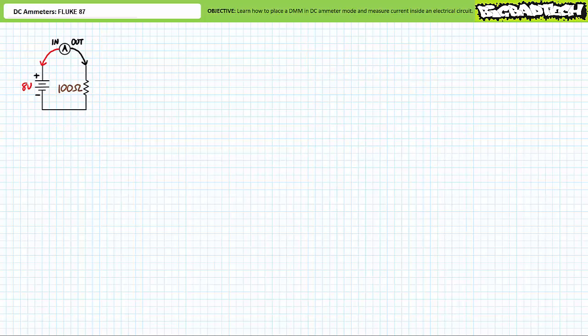Build the circuit exactly as illustrated, step by step, and make sure there is one and only one path where current exists. Take your time and think about it. Really think about it. Draw a picture and talk yourself through it. In this spirit, because the ammeter is a little tricky to use at first, here's a couple ways you might screw it up. Be on the lookout for these mix-ups and be smart enough to recognize them when they happen.